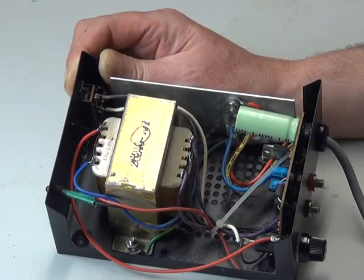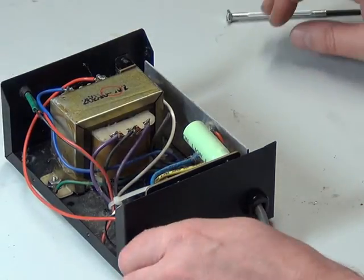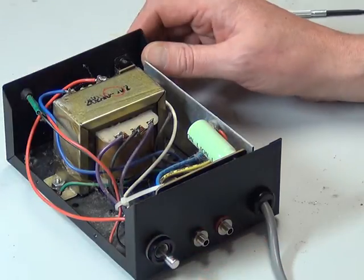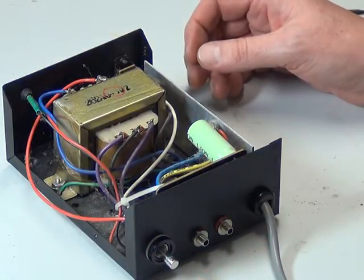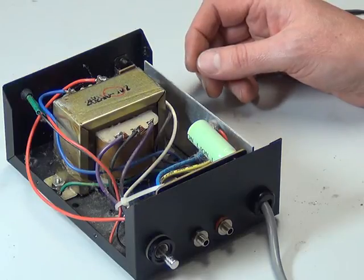The other thing we're going to be doing is putting shrouding on the live terminals, so that if you do open it up, you're not likely to get a shock. Now, if you just withdraw the fuse holder — and this is the other snag — the fuse stays behind. It's not captive with the holder. That means that fuse would now be alive if that was plugged in. So that's another safety problem.